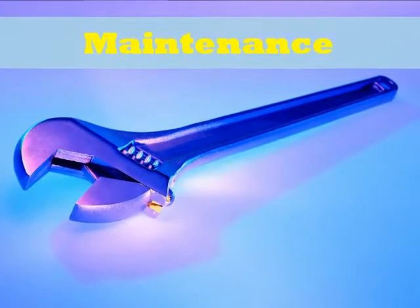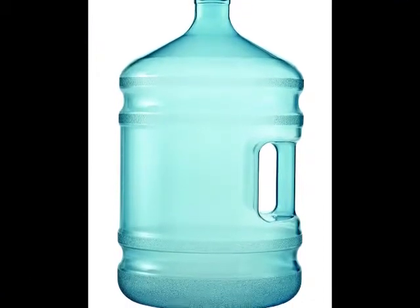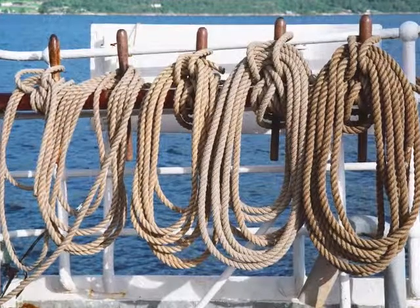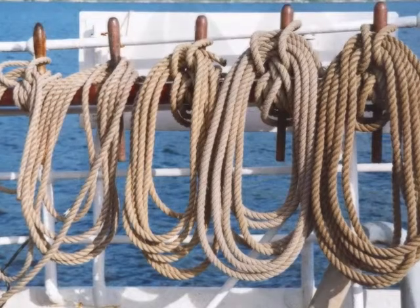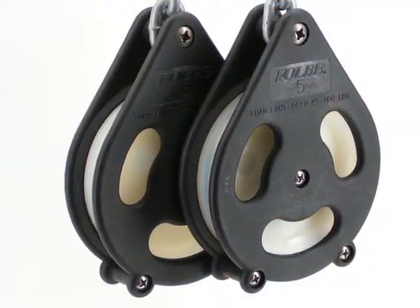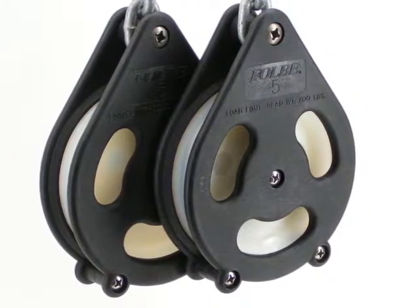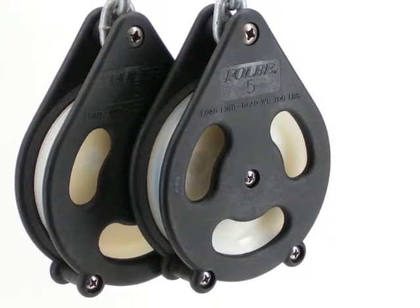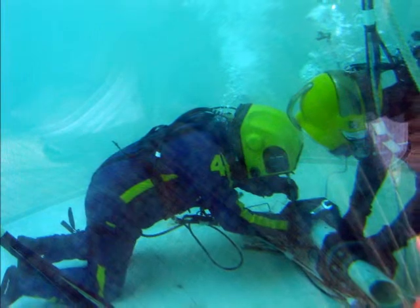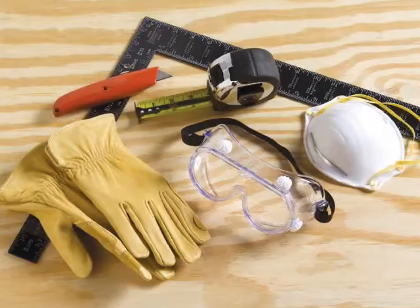The design is simple enough, but what about its maintenance? The floats are obvious — when they start to degrade, simply take them off and put on a new pair. If the ropes or cable start to degrade, simply attach a fresh one at the end of the old one and reel the new one through. If the pulley starts to degrade, simply grab hold of the rope connected to the anchor, raise the whole system up, replace it with a fresh one, and let the whole system down again. No divers are required and very little technical and mechanical expertise is needed, making it ideal for rural communities.